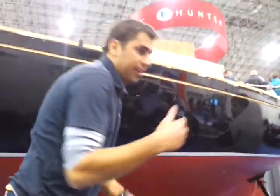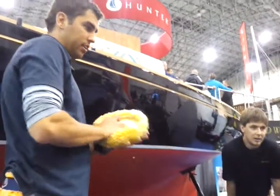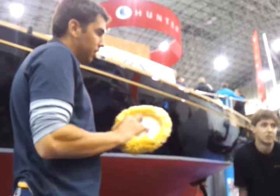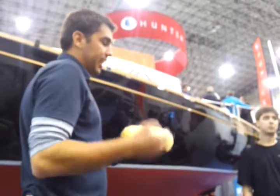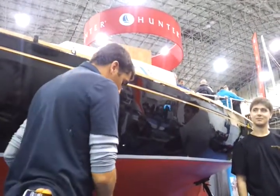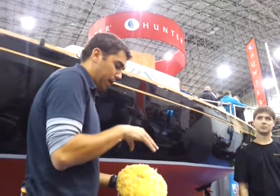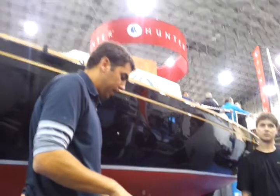What kind of non-skid? Can you describe your non-skid? Is it sprayed on? What boat is it? Yeah, it's an S2. S2, so it has a diamond non-skid. Okay. Yeah, that diamond non-skid is possible. What we usually do for that is a wool pad, not a foam pad, because it would chew up the foam pad pretty quick. But a wool pad, probably a white wool pad with the Imperial.